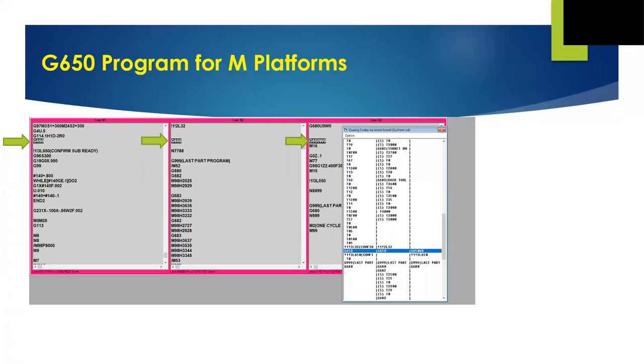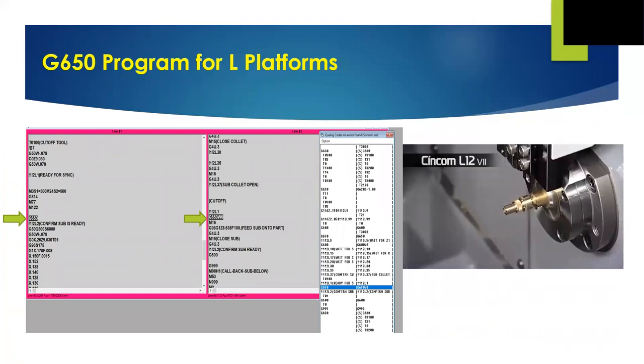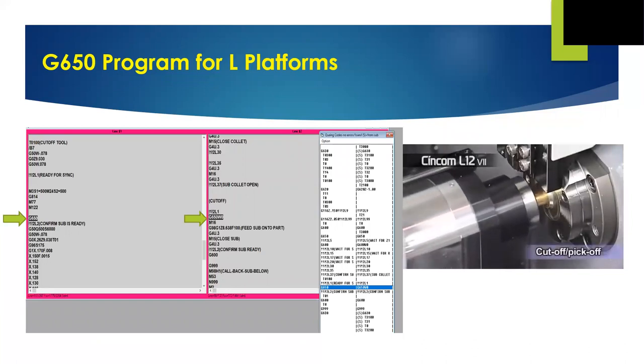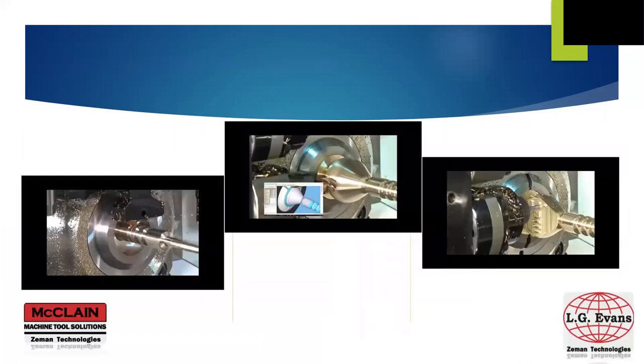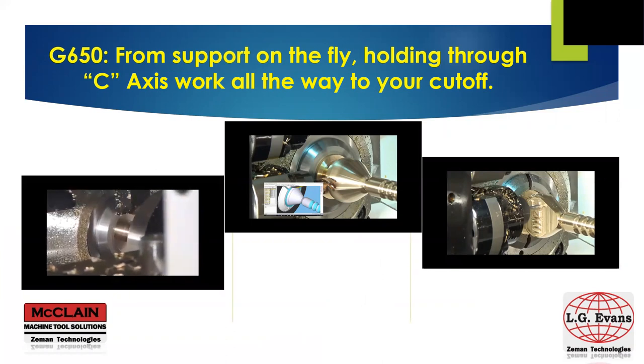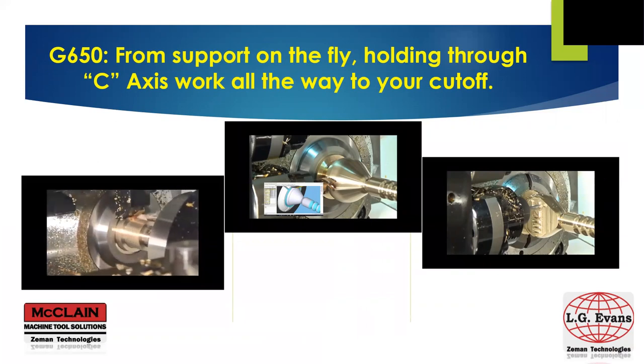The sub gets fed to its cutoff position on the part. The control reads the queuing wait code and the cutoff is completed. When we look at the L program example, it's almost exactly the same as the M without the middle $2 channel. The W0 argument was used again because the sub was already on the part supporting it, and I didn't want it to go back to home — pulling off the part — and then come right back on. In the video, we see the sub-spindle come into a position on the part that is extremely close to the cutoff tool. With a left-handed cutoff tool as shown, I've come as close as five thousandths of an inch away from the cutoff and never touched once. In the first of three videos, the sub-spindle is synchronized to the main spindle exactly before the G650 superimposition. Once the sync is complete, the sub comes into its programmed spot, the collet closes while the part turns, and the sub is now supporting the part as machining continues.